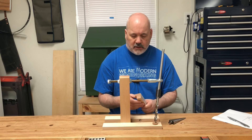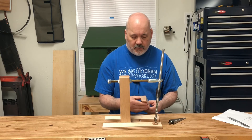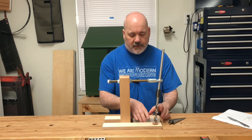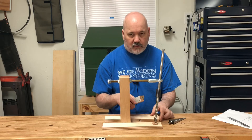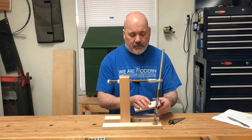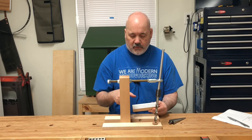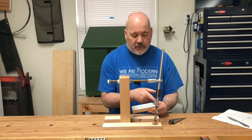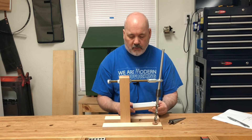Let's talk a little bit about the setup block. This setup block is one inch wide and nests on the left runner. It has a metal disc that references against the end of the runner — that's your zero point, which is zero degrees. Your angles are marked here, going from zero degrees up to 31 degrees in half-degree increments: half a degree, one degree, one and a half degrees, two degrees, and so forth, all the way up to 31 degrees.